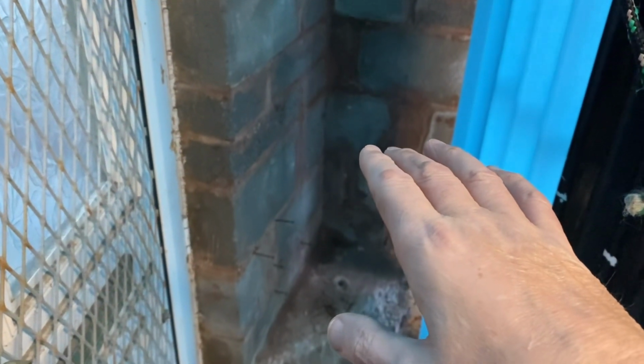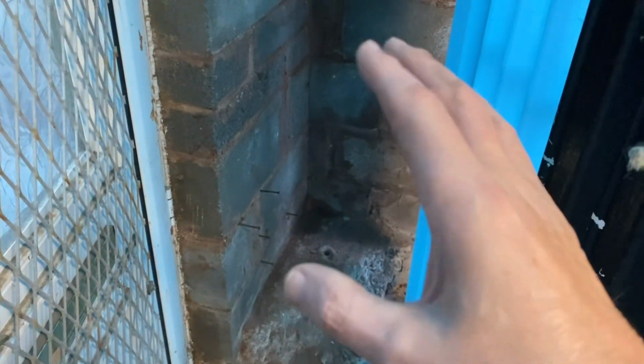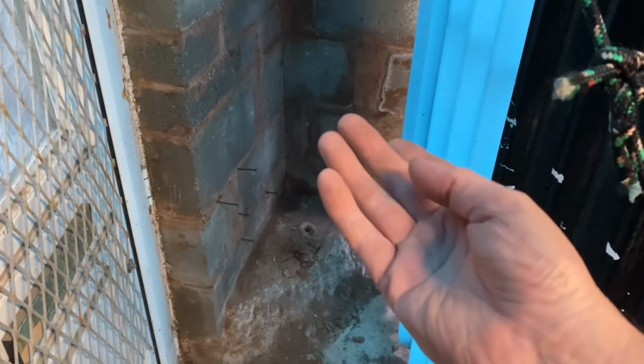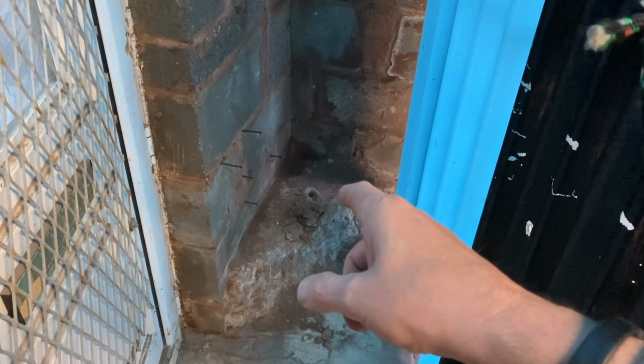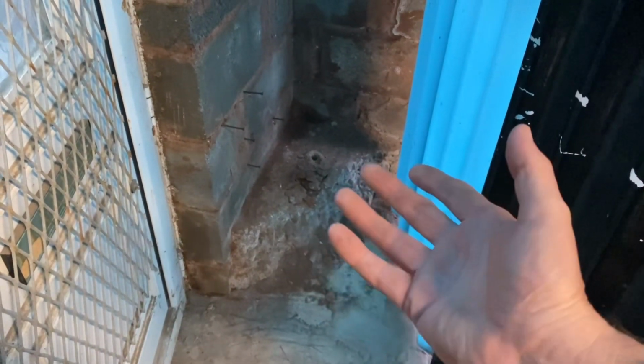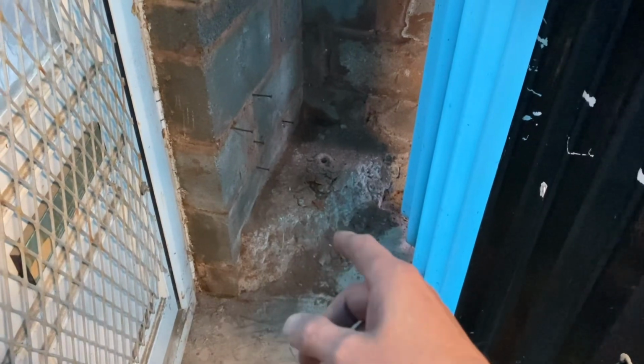I used to be a surveyor for Sovereign Chemicals, so I know quite a bit about damp and rising damp and dry rot and all that. So it could be partially rising damp. It could be that when we put that there was no protection underneath, so this has bridged it and fed the wall with water. The top looks pretty dry.